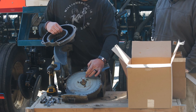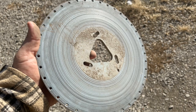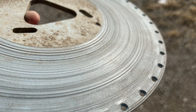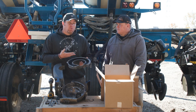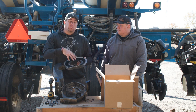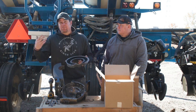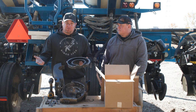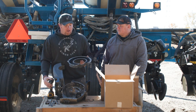You can take your fingernail and really feel those grooves on the back side of the disc. The negatives of the grooves: first, it doesn't create a smooth seal, which can create vacuum leaks and cause you to have to turn the vacuum up on the planter. More importantly, it creates a lot of drag — more driveline drag — and creates issues with that drive line having to turn harder, especially as you start to go faster.